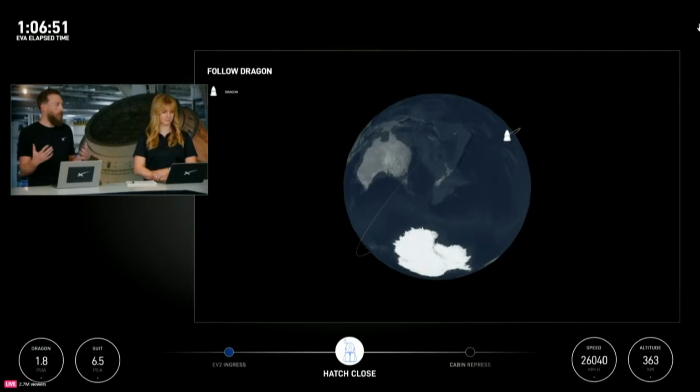Obviously, you have nitrogen and oxygen in your atmosphere. With this, we have O2 flowing into the cabin through the suits, so we only need to add nitrogen. So we're able to just add a bunch of that to really start getting your pressure up. O2 continues to flow into the cabin through the suits, and we're going to continue pressurizing until we're pretty much right back at our 14. Fan 1 coming on, medium speed. Right at about our 14 or so PSI.